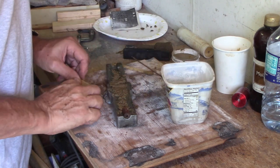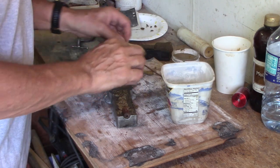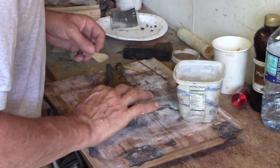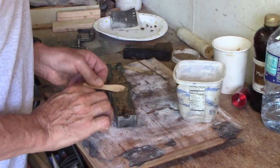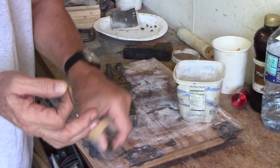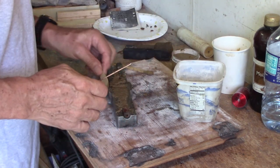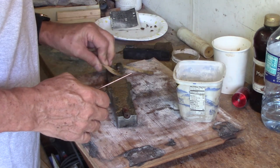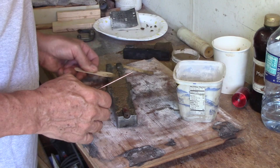This is just a piece of welding rod through there to let steam out. When the hot molten metal hits the mold it's going to create steam. You want to minimize that as much as possible, but you can't completely eliminate it, so you put vents in your mold — little holes with a wire to vent out the steam so the bubbles don't go into your liquid metal and make voids.